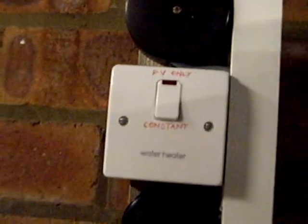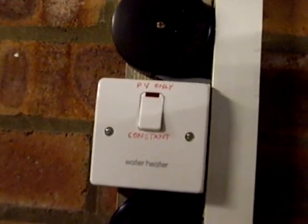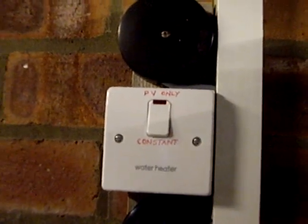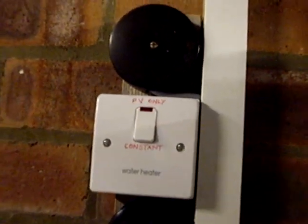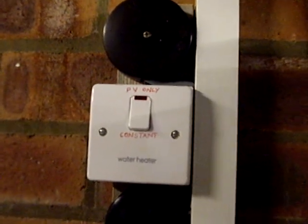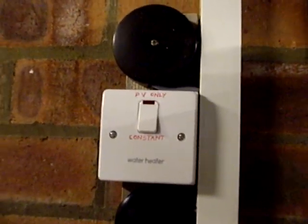The energy bucket isn't 3,600 joules now — it's some number up in the millions, as shown when you first plug the serial monitor in. I'm sorry I've got a sum wrong: the power cal value of 0.06-something should appear on the bottom of the equation rather than the top, so the numbers clearly look wrong. But the code is working, and given a bit of sunshine we should start generating some free heat again. It's a straightforward drop-in replacement for the previous Mark II code but it's a lot slicker. I look forward to hearing how people are able to make use of it — cheers for now.